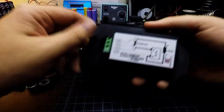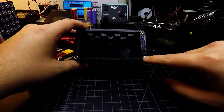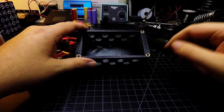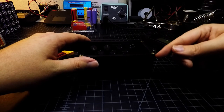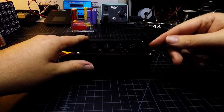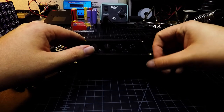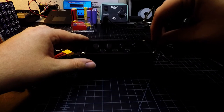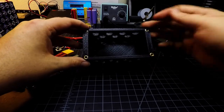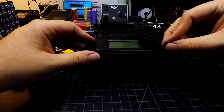This is the final product for the box and the final product for the lid. The two fit together and screw down using M4 brass threaded inserts. You take your soldering iron, stick it down through the hole, and slowly press the threaded insert into the plastic — the heat will cause the PLA to give way and allow the insert to work its way in. Be very careful to push it in as straight as possible, and when you pull the iron away the PLA hardens again and holds the inserts in place.